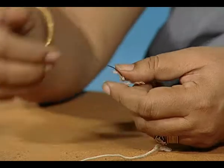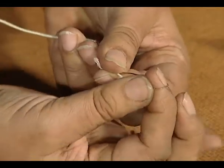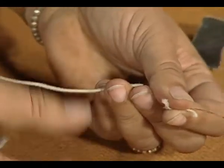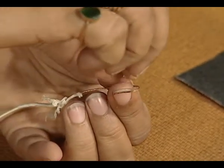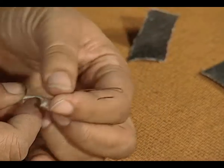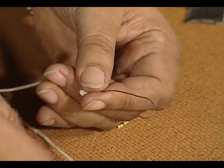Thereafter, to make a clean neat connection, hold the wire like this with your finger and thumb, make a J-shape, make a loop like this. Then put it in the terminal, and when you screw the terminal, the connection is neat and tidy. There is really no need to take the wire round and round the terminal, and that way the wire will last longer in the lab and be useful for many of your friends.